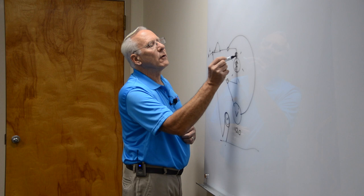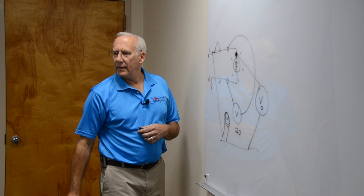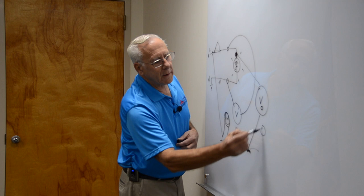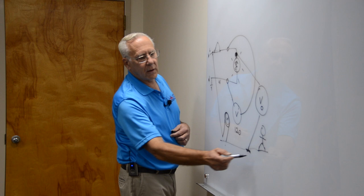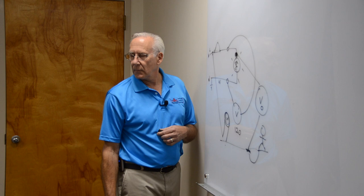If from here to here reads zero, then this wire must be dead. You're standing on the reference point. Your feet, here you are right here. You're standing on the ground. You're standing on the same reference point as your test. Therefore, pretty safe bet, this wire is dead. Do you understand that? Because if you don't, we'll go over it again.